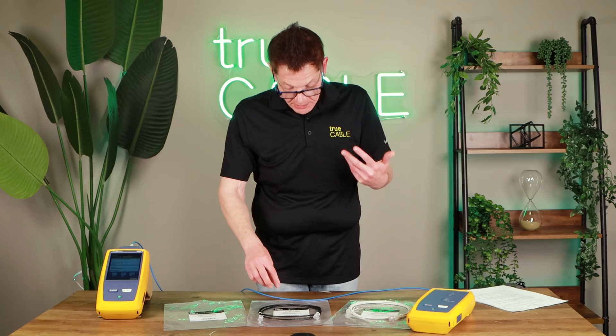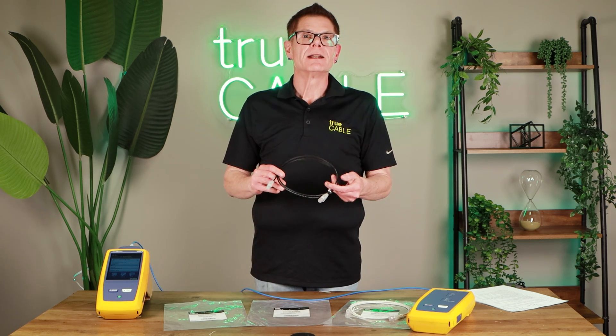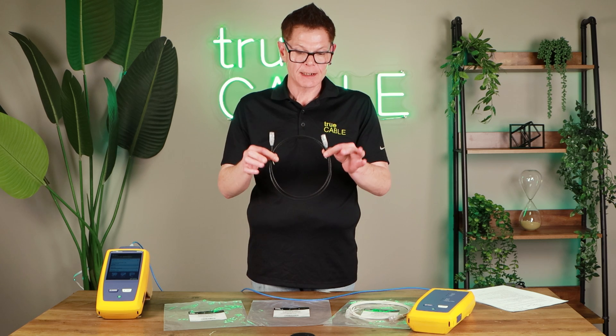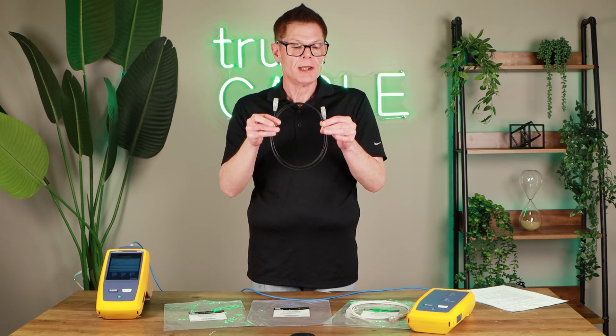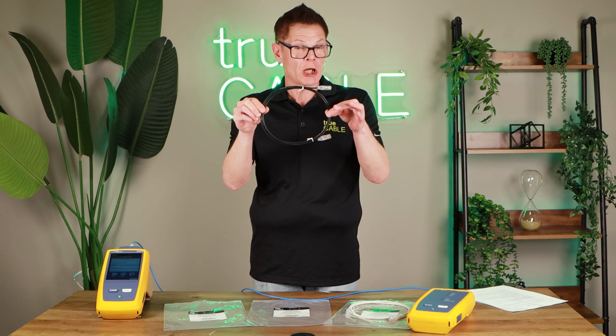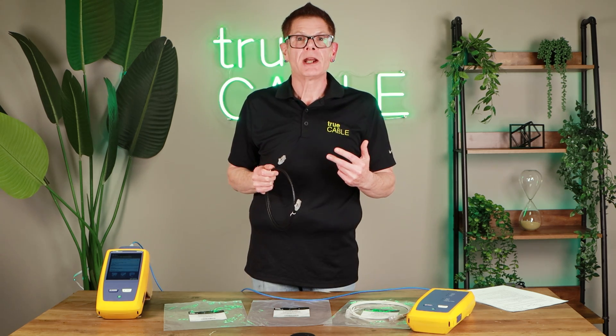It takes a long time to develop a reliable patch cord. What makes our patch cords so unique and different? Sure, you can get 28 gauge Cat 6 patch cords anywhere, but you can't find them where they're guaranteed 100% to pass for every single one you buy. Our Cat 6 patch cords are what's called component rated. In the standard there is a definition around how patch cords have to behave, because each one is its own little individual installation — two connectors and the cable — which is literally a component, part of the overall channel. There is a performance specification that takes all of that into account, and the vast majority of patch cords on the market — about 75% — don't meet this standard.